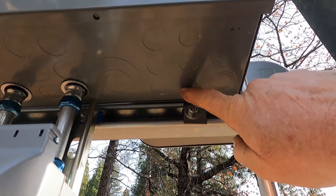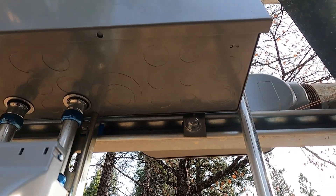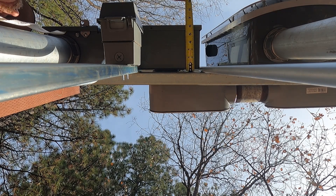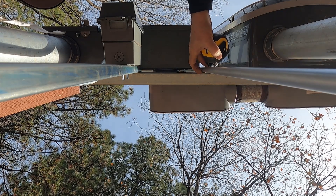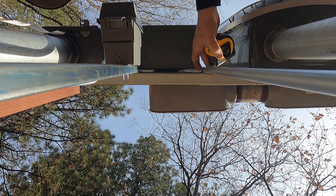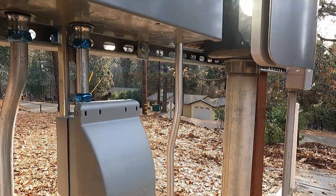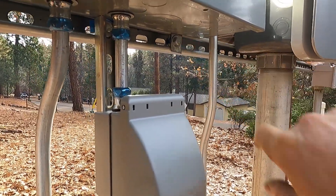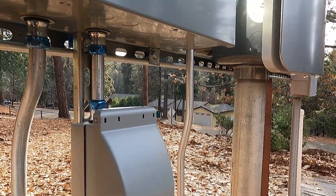I want to go to this knockout right here, so I'm going to need a little offset right here. Let's figure out how far I need to go. It looks like the center of the tube needs to be at inch and a half. So from this side of the conduit, I'm going to offset, and the center line should be at inch and a half. I've got the offset made. Now I just need to know where to cut this off, so let's knock out the space we're going to put the conduit into and put the connector in there so I know what the measurement is supposed to be.